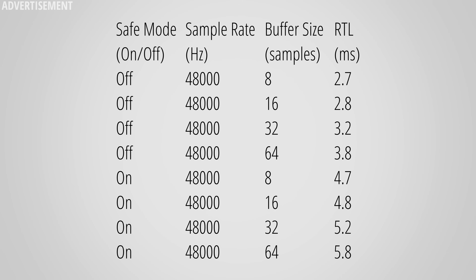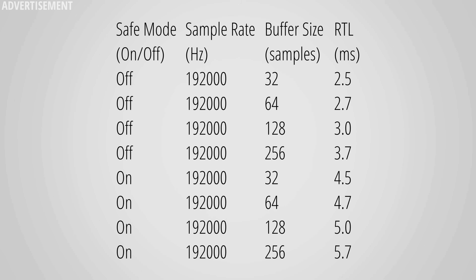Let's quickly check out round-trip latency, which is especially important as there are no internal software effects on the Volt 876 — meaning for an amp sim, audio needs to be routed through the PC. Generally the latencies are really low, but I was especially surprised by how low you can get them when disabling safe mode. On many interfaces you usually gain about a millisecond, but here you actually gain two, bringing latency levels down to levels I've only really seen with RME interfaces. Without safe mode there's an increased risk of crackling audio, but you're not limited to high latencies out of the box. With higher sample rates these are still excellent round-trip latencies.